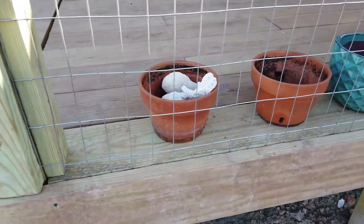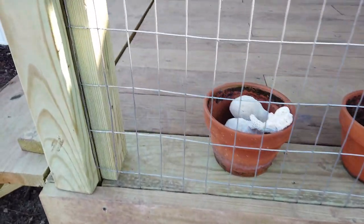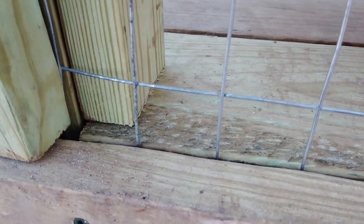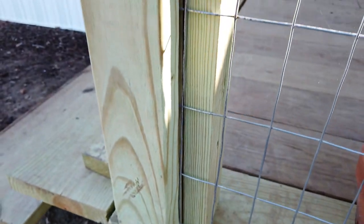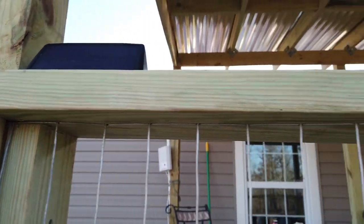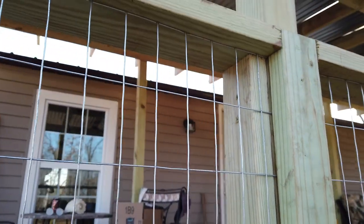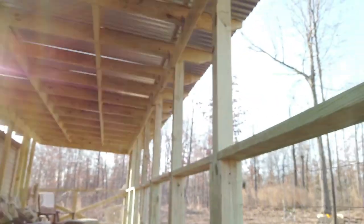So what we did with the horse fencing is we took a 2x8 on the bottom and we put the horse fencing down. We stretched it out. We stapled it in. And then this 2x8 right here went in between the horse fencing so that it would be nice and secure. And then on the inside, we took 2x4s, and then we hung a 2x6 between the two beams right here. There's one, there's the 2x6, and there's the other one. And what that does is it gives a nice railing, and then it also secures the horse fencing